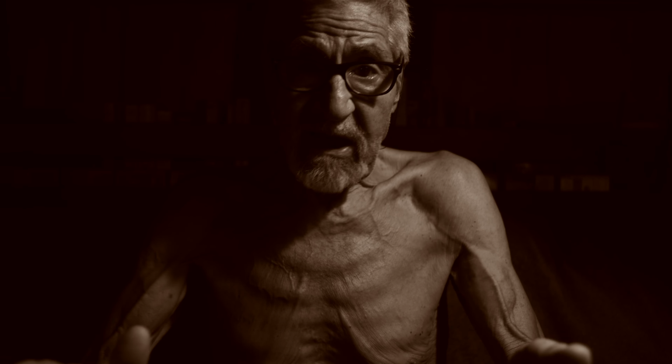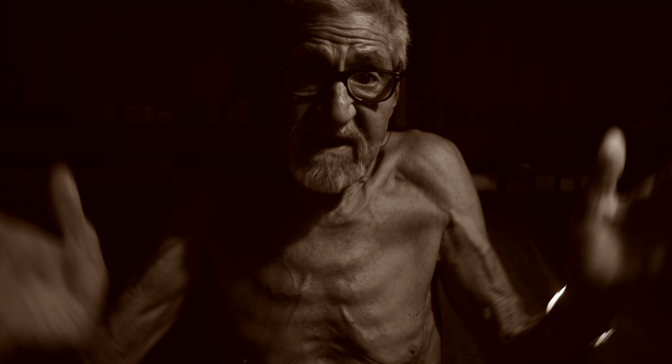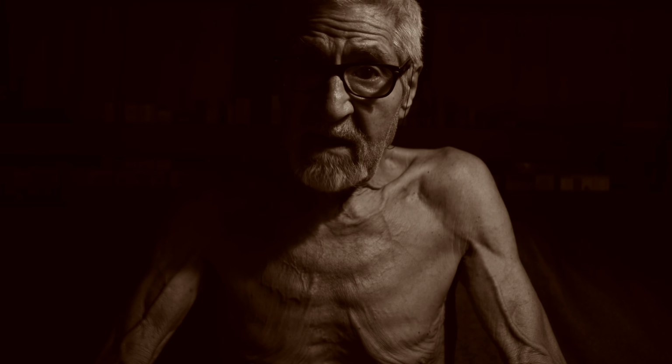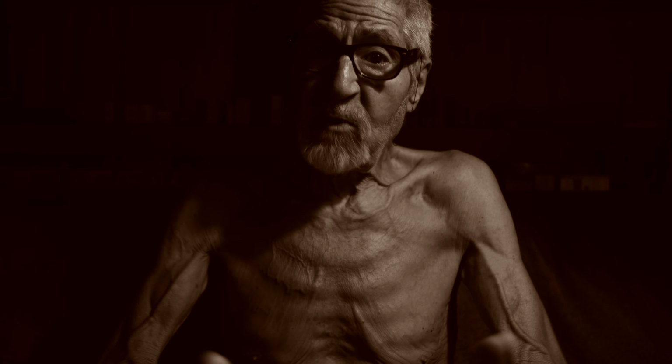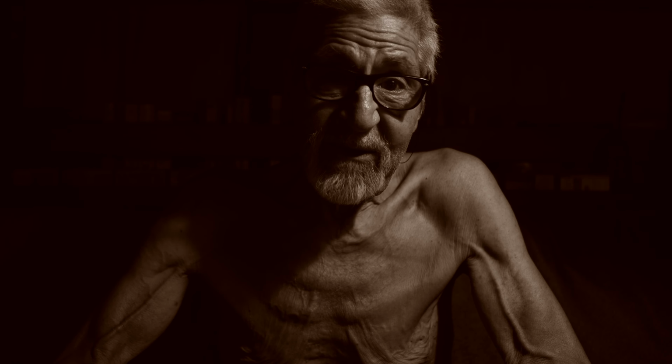If you don't take care with a thixotropic agent and the resin decides to puddle, you end up resin rich near the bottom, which should be the strongest. Anyhow, none of that. It worked out perfectly. So we were very, very pleased with the job.